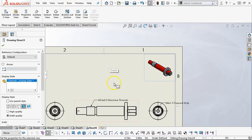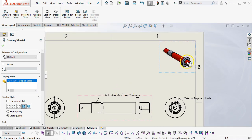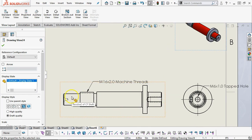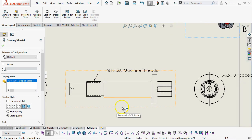Right, so I'll go back and pull those up, but I want to remind you, as you're going through and you see this, that we'll pick one of these. We have the central axis as a datum. Technically, the bearing is being supported for 12 millimeters at this end and 12 millimeters at this end, and so it doesn't necessarily need the entire length, but it's probably as easy to go ahead and control it, or we're going to call it out as a from and to type tolerance.